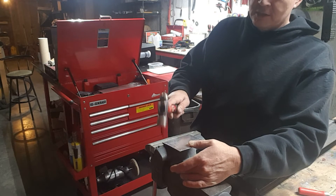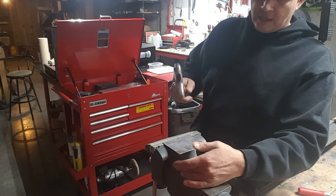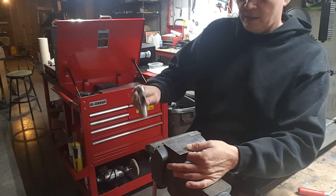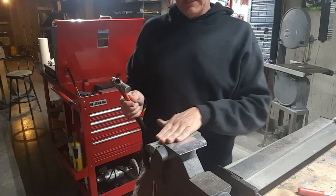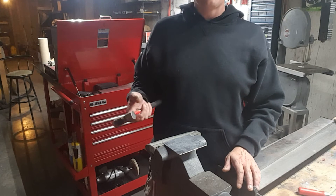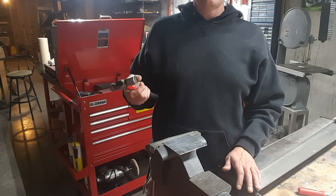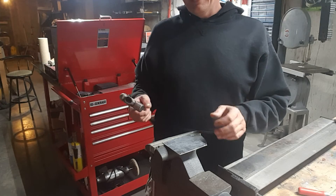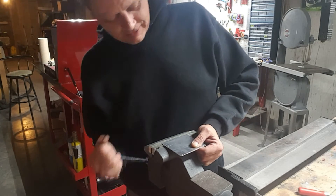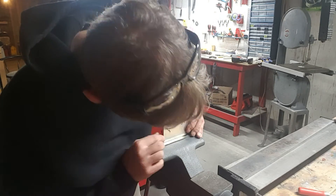What we're doing is bending it just a bit at every spot we hit, but not bending it so far that it skews the bend or stretches the aluminum in a weird way — just a little bit, then catching it up across the piece. When you start getting towards flat, aim mainly at that bend and make it as sharp as you can. Another reason not to hit it too hard: softer aluminums will dent, and if you don't put a nice dent in it, you'll put a dimple in it that you'll have to fill or file.